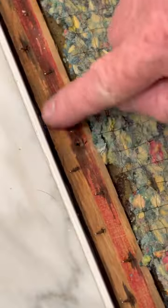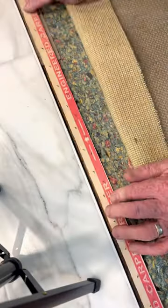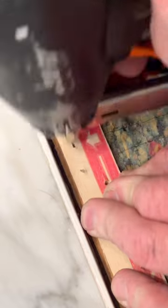I'll protect the tile edge and bend the pins from the strip so I can glue a new piece of tack strip in place. I'll shoot brads in to further strengthen.